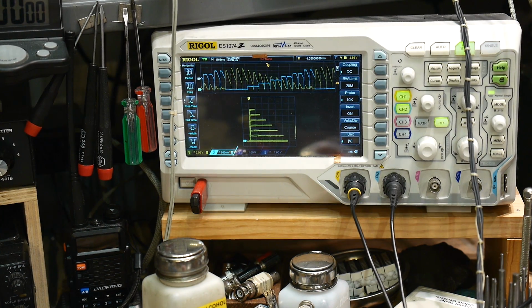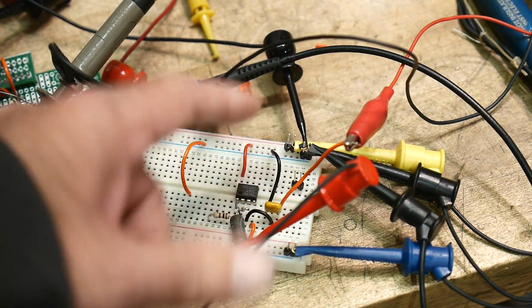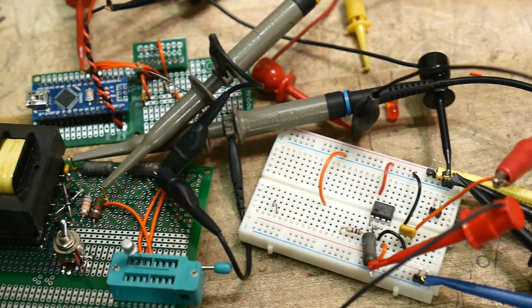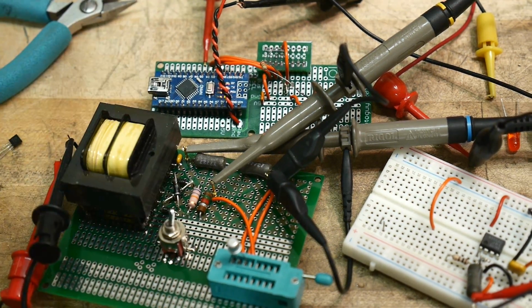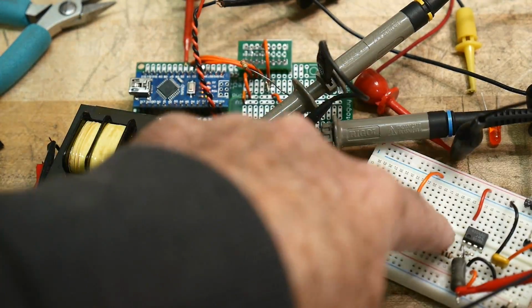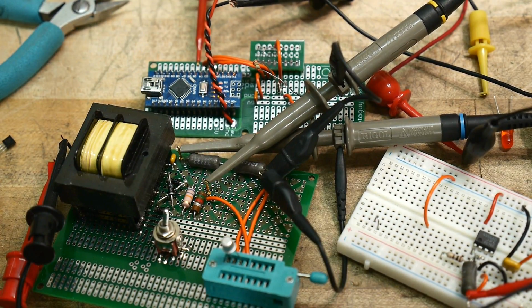So yeah, it works much, much better. I think I'm on the right track here. I think I probably need to maybe put a transistor output buffer even on this high current one, just to boost it up even more, maybe plus or minus an amp or something, just so I can drive things harder. And make it adjustable. Right now I can adjust the voltage on the function generator, but I'll have a potentiometer here that I can adjust the collector voltage, so we can swing it back and forth. Probably have a couple ranges and a couple swings.